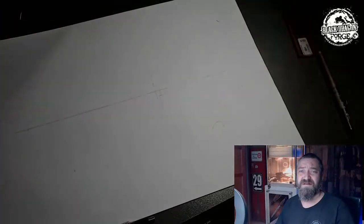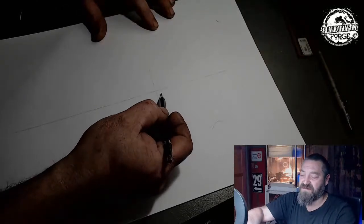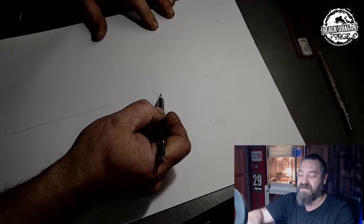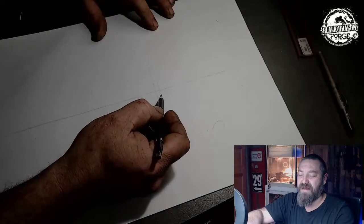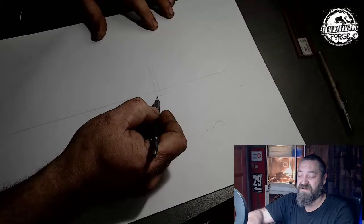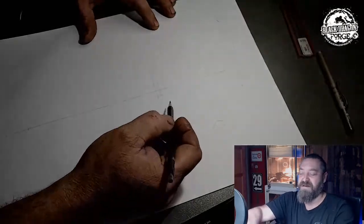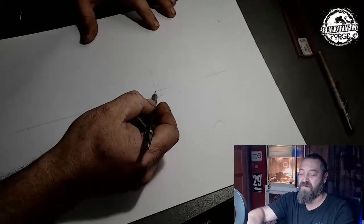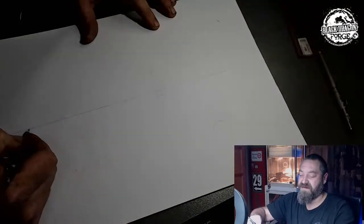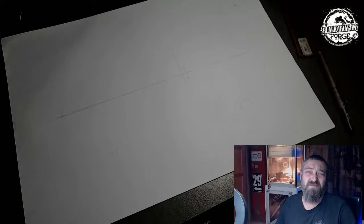Like I said in the description, I start off with a 90 millimeter handle. From the Quillon block, which I've already drawn in, 6 millimeters thick and 20 mil wide, so 10 mil from the center line out, 6 mil down. From there to my top little mark is 90 millimeters, and then double the handle length from this point forward is my line down here, which is 180 mil. Those are rough guides that I start with, nothing more, nothing less. It's purely a guide.